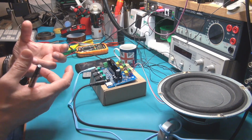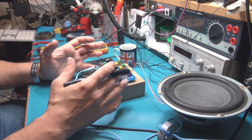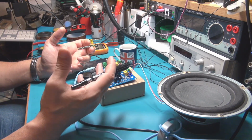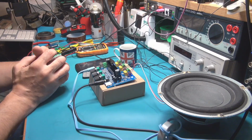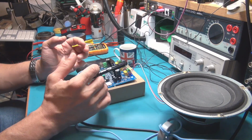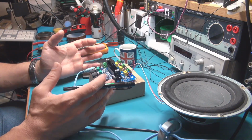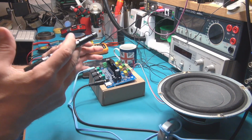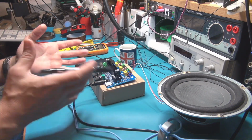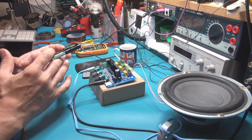The difference in how this amplifier works is the standby current. If you use a high voltage, in the same way you get a higher standby current than with a lower voltage. If you use this device at 12 volts, you can consider that this amplifier is working in eco mode. And of course, if you supply this amplifier with 26 volts, which is the maximal voltage you can supply, you can consider that you are using your amplifier at the maximum power you can. And also your standby current increases at the same time as the power supply.